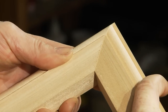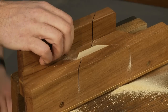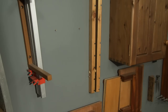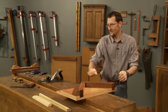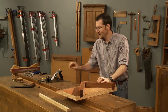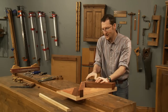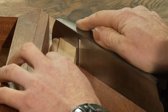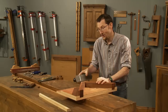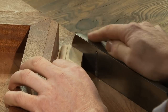That's a reasonably good fit straight out of the miter box, but to get it absolutely perfect, I'm going to use a miter shooting board. It's really important to use a freshly sharpened plane for this, because otherwise the fibres won't cut cleanly at all. Also make sure that the iron is set absolutely parallel to the sole of the plane — if it's not, what you'll end up doing is planing a slight chamfer on the end of your mitered moulding, and you don't want that at all because it won't fit properly.